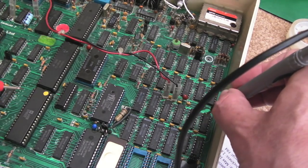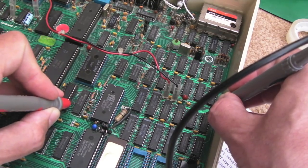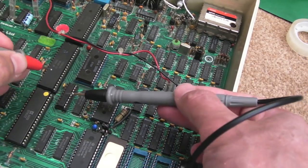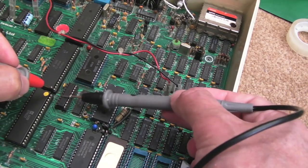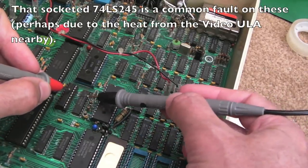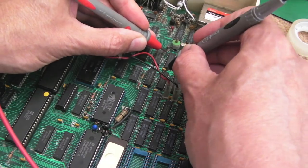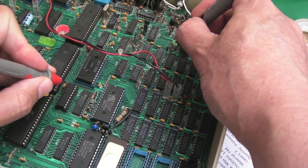There's a socketed chip and I can tell it's a repair — not a factory socket. This is why I went down this road of testing connectivity. I've discovered all chips are connected correctly to the 74LS273 and to the other chip, apart from these two chips here. Let me check they're joined together — yes. But going around the 273, nothing — no connection, nada.